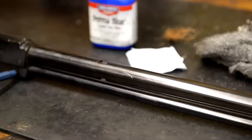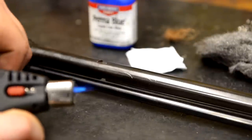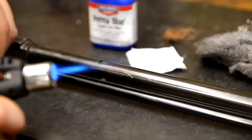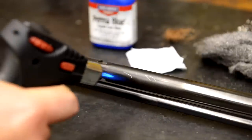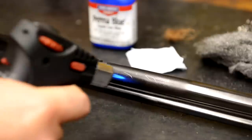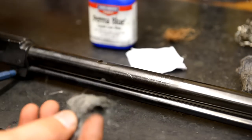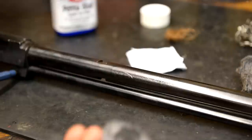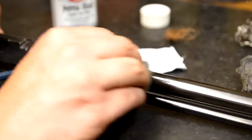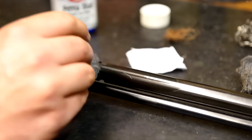We're going to touch up these scratches first with the Permablu, the other set of scratches with the 4440. Grab yourself a small butane torch — very small, you can see how small this flame is. Just going to heat up the area just a little bit. Just going to help the bluing kind of adhere, helps open up the pores in the metal a little bit. That's really all you're doing. This barrel is acting so much like a heat sink, it's going to draw a good bit of this heat away. Put a little heat on it. Tear off a small tuff of steel wool about this size. Grab some Permablu — a dab will do you. You'll know what's on there because it will blue the steel wool. Just take it and apply the bluing solution with the steel wool, and it should kind of help blend that stuff in pretty decent.